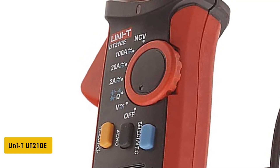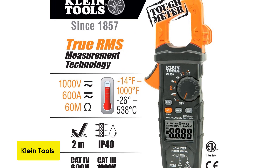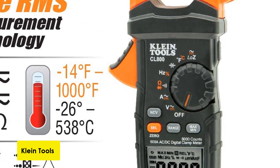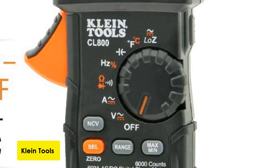Although it can measure only up to 100 amperes, it is still considered one of the ideal clamp meters available on the market in terms of versatility. At number 4: the Klein Tools CL800 Digital Clamp Meter. Unlike the Fluke 323, the Klein CL800 can measure both AC and DC voltage, along with resistance, capacitance, frequency, and test diodes through test leads, which generally makes it quite functional for both domestic and commercial electricians.